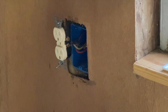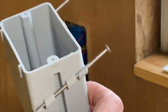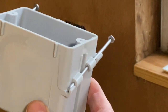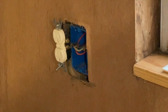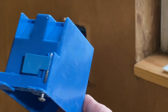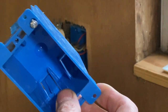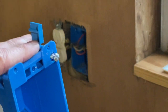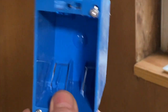This is a new construction box for a duplex outlet or switch — it has nails you nail into a stud. What I managed to have is one of those swing clamp wall-mounted outlet enclosures. You cut a hole, slip it in, turn it, and the wing flies out and compresses against the back of the wall on the top and bottom to hold it in. That's what we'll use on the outside.